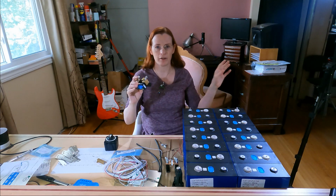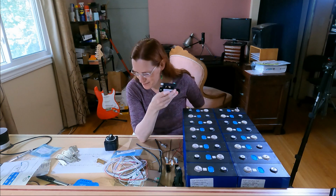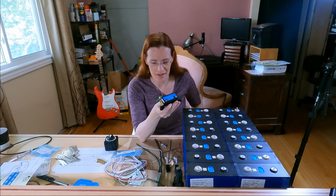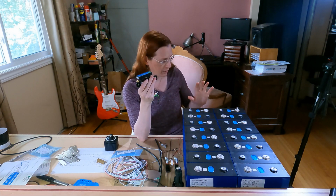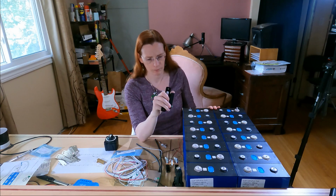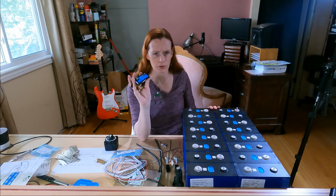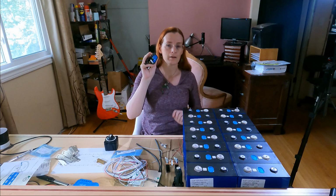I'm going to be using a lot of Victron gear in here. So again, I had no clue what this was. I had no clue about anything. What this does is you tell it when you have a full charge in the battery, and then you drain it down to complete empty, and you tell it that it's done. I'm not exactly sure how you tell it. It's a Bluetooth app, so maybe it just figures it out by itself. In any case, the smart shunt is able to learn how much capacity is in your battery.